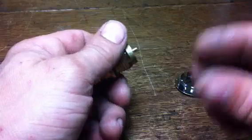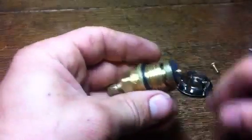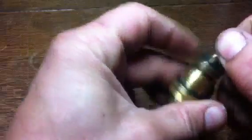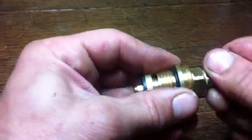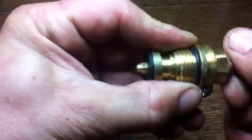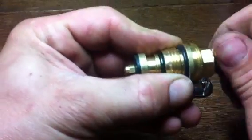Anyway, so that comes out. You can unscrew it because they're always a bit tight if they're new. Obviously, this tap's never been used. You can turn it over. Right, now, if your tap's a bit stiff to use, what you do is screw this down to get the carriage out, like so, and the carriage will come free.